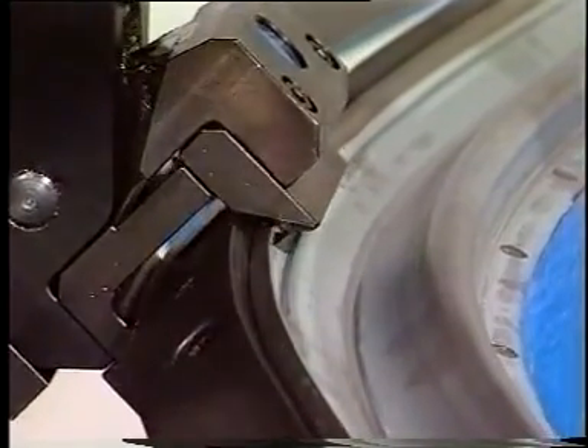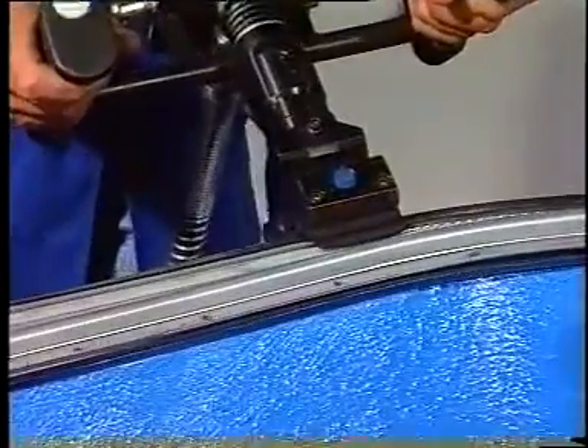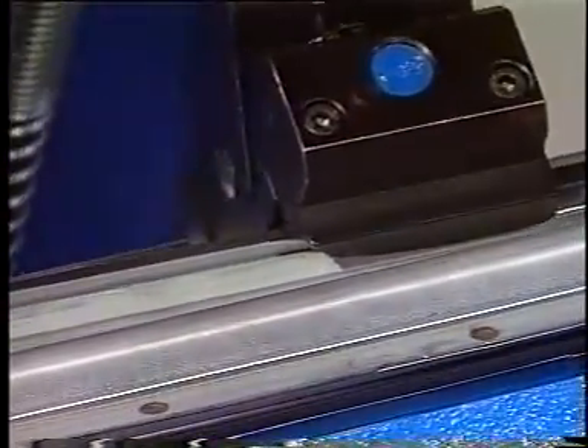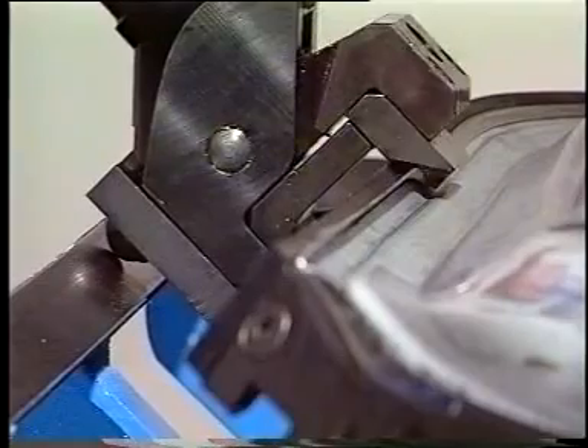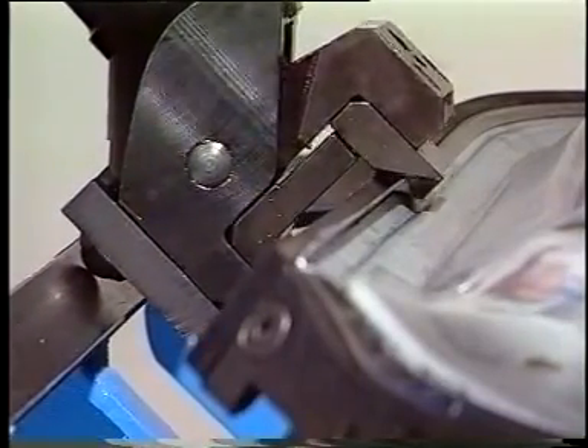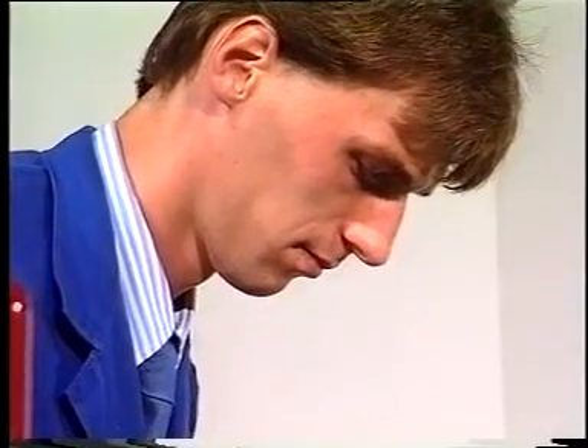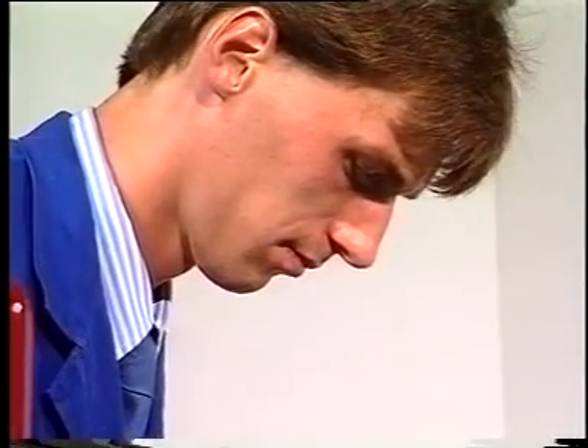The restricted guidance of the seam closing tool in the jig enables straight or even tightly curved parts, joggles, and highly complex workpieces to be clinched. The feed speed amounts to a maximum of 10 to 15 millimeters per stroke. The sheet edges can be pre-folded between 10 degrees and 115 degrees, and the flange heights can measure from 8 to 15 millimeters on a sheet thickness of 0.5 to 1.5 millimeters.